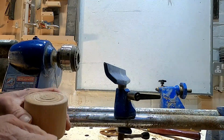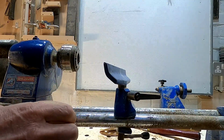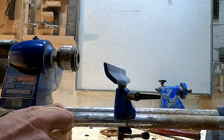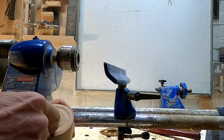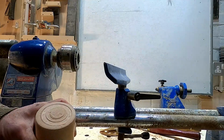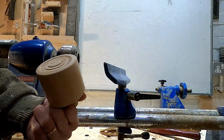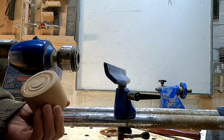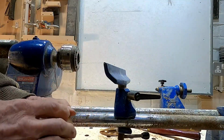I don't know why. So what I can probably do is, because you have to cut in anyway, because it's not a complete circle, the hand's only about three quarters of a circle, I might just cut the middle out with a bandsaw, then just sand up the inside. Will probably be the easiest way. So I've done most of the work to create the hand on the lathe, so it sort of worked. I'll make these up and then I'll come back and film some more.